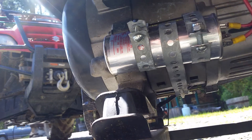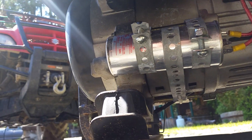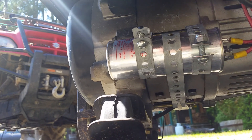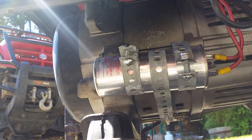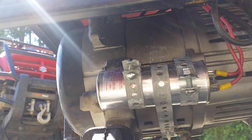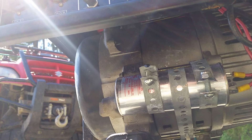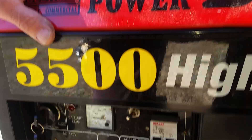There was no place to mount this monster — I deliberately got this size. The original was a 35 microfarad 400 volt, and this one's a 50 microfarad 450 volt. The difference is this is generator-specific, specifically designed for generator duty, and its duty cycle is much much higher than the original equipment. So it should outperform anything the original capacitor did.